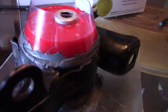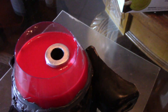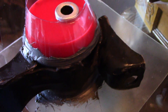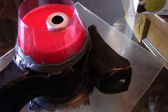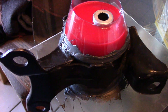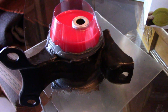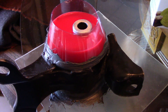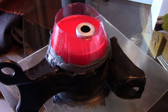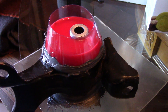It's poured and you can see it's still liquid right now — that's how it's going to dry. I forgot to mention: as a releasing agent, you coat everything with turtle wax so it doesn't stick. You don't have to buy anything expensive — turtle wax comes in huge containers for about three bucks at Walmart. Let it cure for 16 hours, and that's not the last step — after 16 hours I'll show you what you're going to have to do next, otherwise it's still not going to be fully cured.